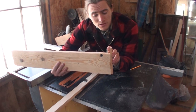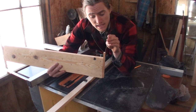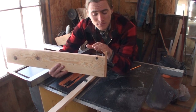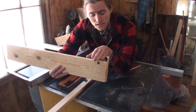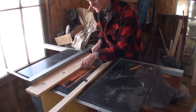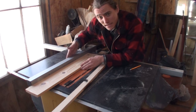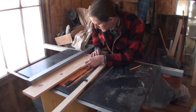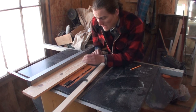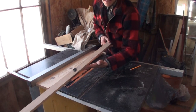It's just a board with a piece on the back to back up the workpiece so it doesn't move, and then a screw that makes the adjustment for the taper, combined with where you place the fence. Make sure the piece on the back sticks out far enough to support the variety of tapers you may cut. When I said the screw is what the piece pushes up against, I mean on top of it — it pushes the bottom of the element you're tapering out or in far enough to get the desired taper. It rides up against the fence.